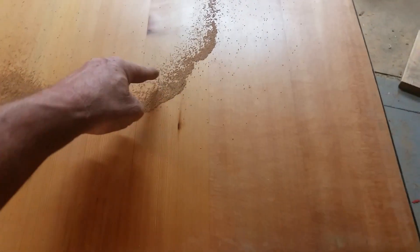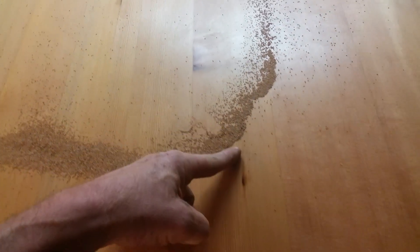Where it probably would have been a circle, it's coming more this way. Right under here is where the scalloping starts — this area was super thick, the size of the rib — and right here the scalloping started getting thinner. That allowed the sand to come more into this corner than in the other corners where the ribs were thick.